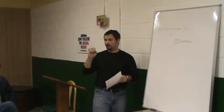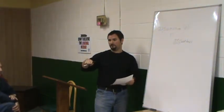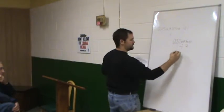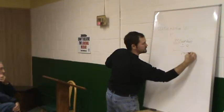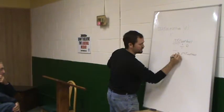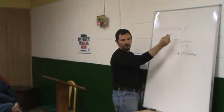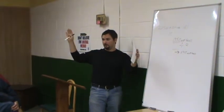But when you're figuring how big and how many batteries you want, you're gonna compensate for that 50% discharge rate, okay? So this gets cut in half, divided by 2. So now you've only got 675 watt hours, all right? That's the real power that you have to fool with because you're not trying to kill your batteries, they're expensive, okay? So when you're building your system, don't forget to divide by 2 for the battery because you don't want to go below 50%. You can, but you're going to kill the cycle count, right?